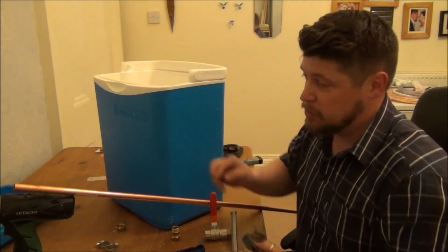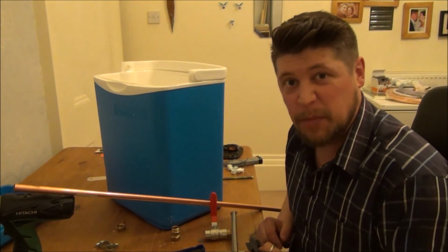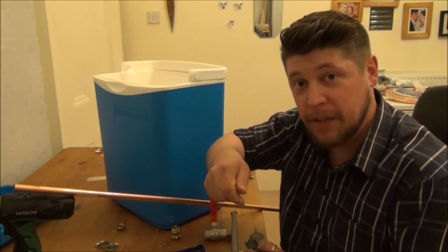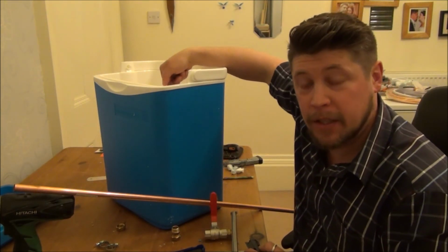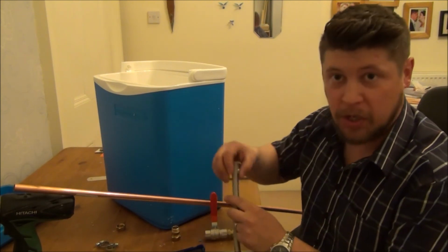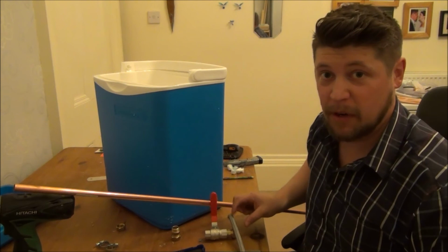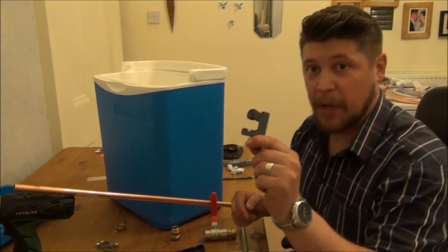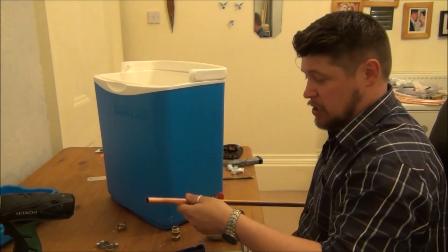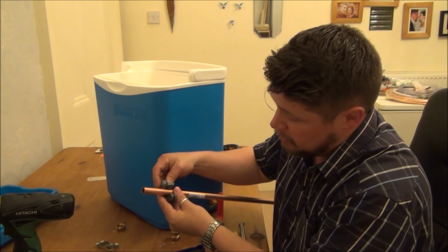Now what I'm going to do is I'm just going to cut maybe a 4-inch length. It doesn't need to be a lot, it only needs to be a little bit sticking out the end, which will friction fit into the inside of the tank connector. And then just enough pipe to go inside this to give me something to stick a Jubilee clip round and hold it down tight. So it really doesn't need to be very much at all. Just going to use a basic pipe cutter to do that, give me a nice edge. You could hacksaw it, and that's not a problem, but I like to use a pipe cutter